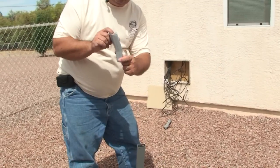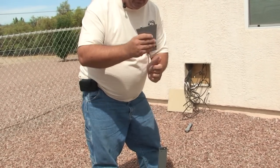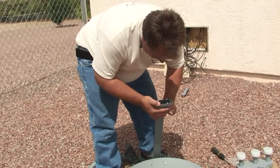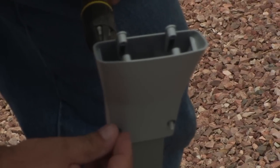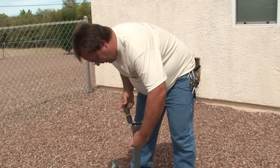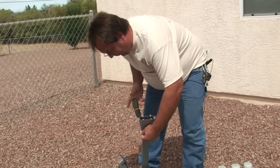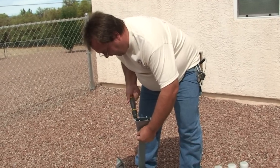The Y-bracket has an unusual shape to it — it's sloping on one side. We want to make sure this sloped side is up. There are two holes that hold the Y-bracket in place on the polar plate and keep it from sliding up and down. We're going to take our fine-threaded bolt and put it through the bolt holes in the Y-bracket. To tighten it down, we're going to take a Phillips-tipped screwdriver from the top of the screw and tighten the nuts down onto the Y-bracket.